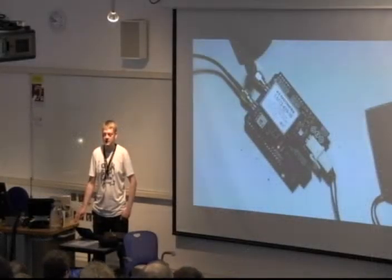Were those all the same, actually? Two of them were from Farnell. Yeah, they were the LPRS, Low Power Radio Solutions ones. It's difficult because, unless you've got an RF meter, it may appear to work on the ground absolutely fine and then it'll get 50 metres away and you'll lose it, which is quite frustrating. Best advice I can give you is run a quarter wave antenna, make one. They're not difficult. It's just a bit of wire and a soldering iron. Somebody who had no experience in soldering at all made one the other day, and I would use one of those over a stubby.